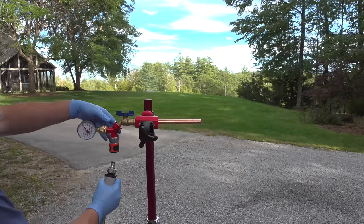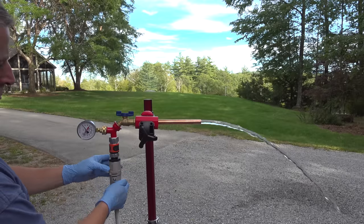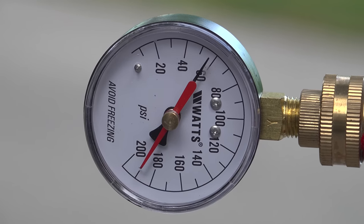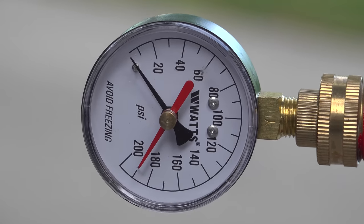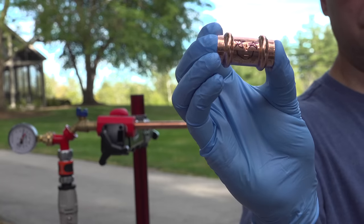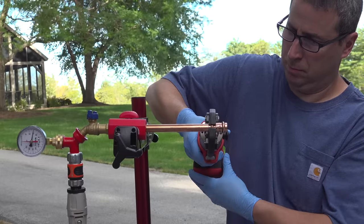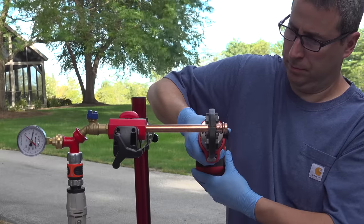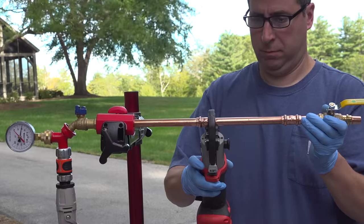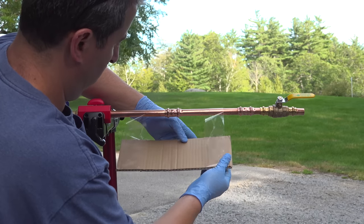Here I've got my plumbing simulator. I'm going to connect my garden hose to the system — it's equipped with a gauge so you can see I'm getting about 50 to 60 psi, which is your average household water pressure. Compressing this fitting on the end of the pipe is easy, but that's not really a pressure test, so I need to put it in the middle and attach another piece of pipe with a shutoff valve. This will allow me to make sure the pipe is completely filled with water, since having air in the pipe alone might not be an accurate test. I also hung a piece of cardboard in the middle to detect any leaks from the joint.